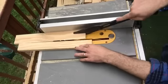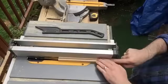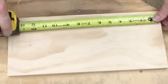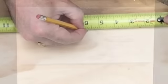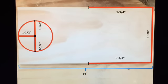Now I'm cutting out the slats for the sides — there's a larger one on the bottom and a thinner one on the top — and I'm going to re-saw them down to a quarter-inch thickness each. For the sides, we start with a board that's 14 inches in length, mark a point, and cut it to six and one-eighth inches wide to match the base width. Then mark a point five and three-quarters inches up on both sides, three and a sixteenth inch in, and one and a half inches down — that's your center point. Draw a one and a half inch line out from each side and a three-inch diameter circle around that, connect those points, and that is the pattern for your sides.